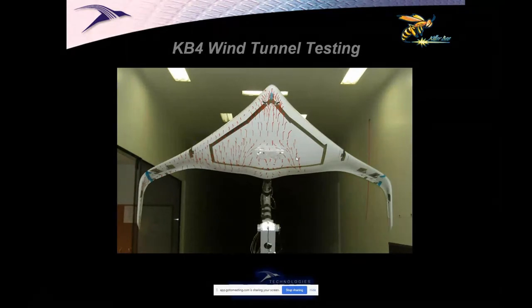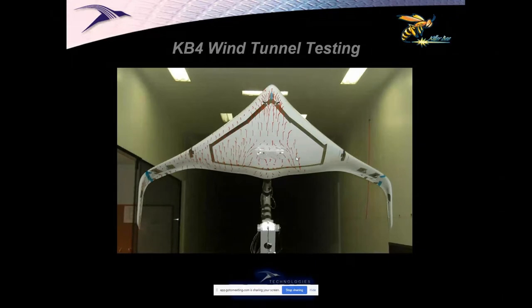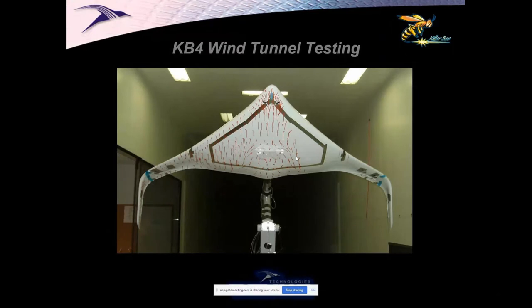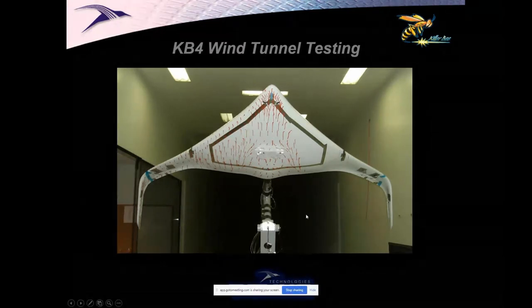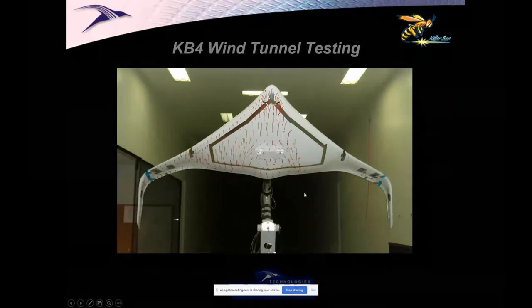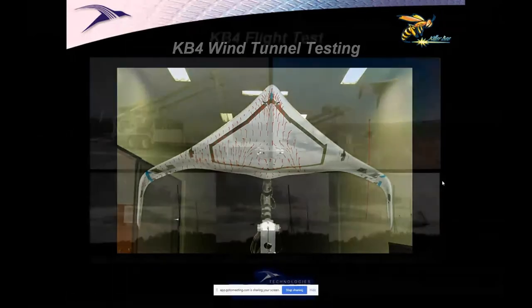And he got nervous and he said, "I don't like the extra drag." We thought it would be good. We thought it would help him stabilize the phugoid. But in the end, he didn't like it, so he retracted the flap. The next thing we know, none of us outside can see the airplane. It has plunged 75 feet instantly when he retracted the flap, hit the runway, bounced off, collected up sagebrush pieces in the wingtip hooks, scuffed the nose, but these protected the prop, and it got airborne again, and we didn't even know it hit the ground. No one knew what happened except, why is it now carrying sagebrush in the wingtips?